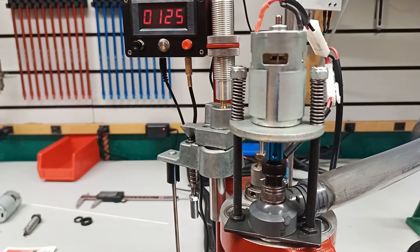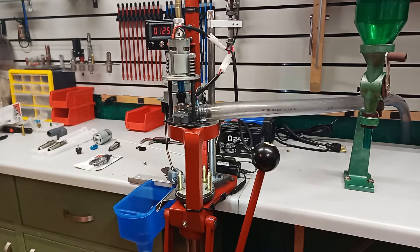Today I'm going to talk about this contraption I built that turned my Hornady Lock and Load AP press into a progressive brass processing machine. I'm going to show you how I did it and the parts I used. What this allows me to do is full length size, decap, trim to length, deburr, and chamfer the case — so when it comes out, other than what you have to do with the primer pocket if it's military brass, you can just load it. It's ready to go.